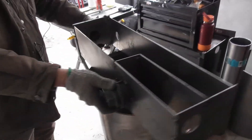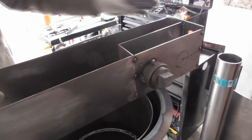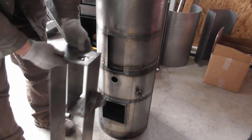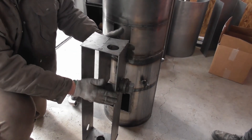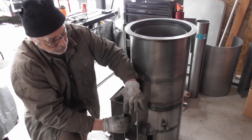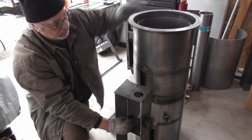The heat exchange piece itself — that's the top and this is the bottom. We've got two clean-out ports: a two-inch clean-out port on the bottom and a two-inch clean-out port on the back. There's a divider plate that forces the gas to go around the pyrolysis liner and then out. The gas comes up, rises, goes in, circulates around, comes back into this little chamber, and then exits. Previously, we came out the top and did a U-bend into the cooling assembly, but we're changing that design. Now we're going to come out the side and go directly with a 90-degree bend into the cooling assembly, which will make it cleaner when we put the lid on and won't interfere with the lid hinge.